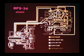When the selector lever is in intermediate or second, the selector spool is positioned to engage the C1 and C3 clutches. Pressurized oil is directed from the selector spool into the C1 pilot circuit, which is routed through the reverse lockout spool lands. The C1 pilot is actuated, permitting pressurized oil from the supply gallery to pass through the pilot and into the C1 clutch.